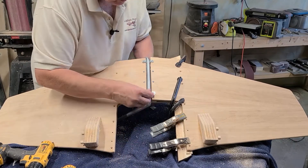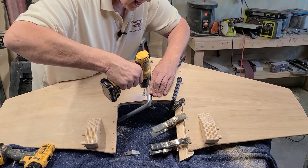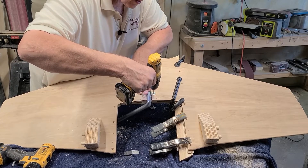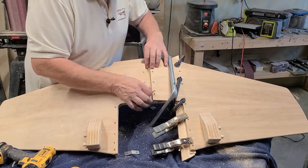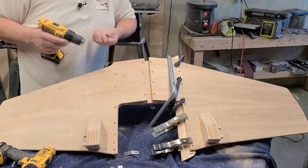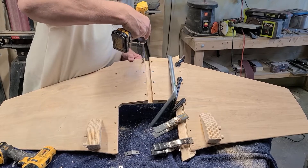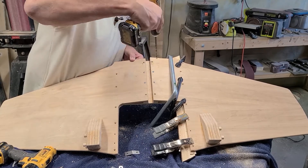This bracket here comes flat, so you have to bend it just a little bit of an angle to fit the dihedral of your wing. So you get these four holes drilled, then you take it back off just for a moment. Drill a quarter inch hole back down through here, all the way through the seat, for location.